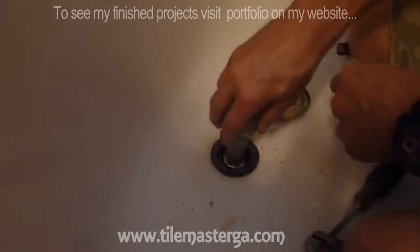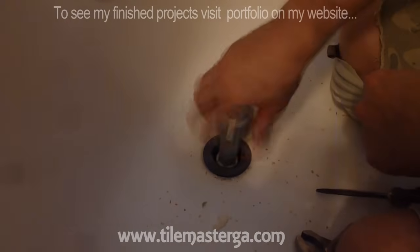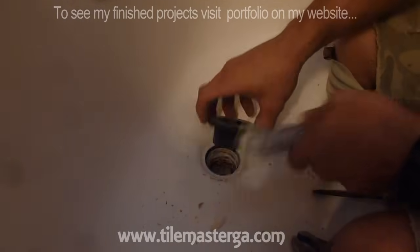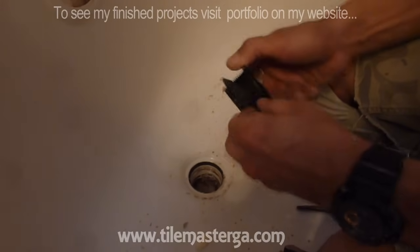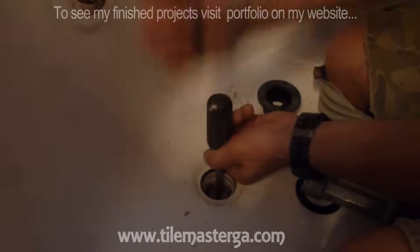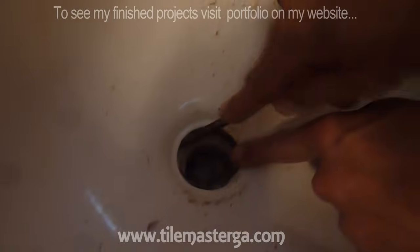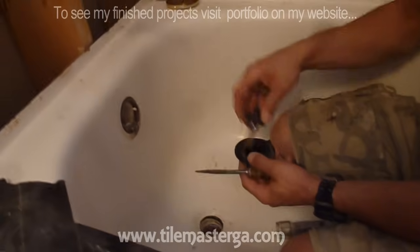Let me unscrew the drain now. I don't know who did that, but it was hardly in place — this was the easy one. Sometimes you have to use quite a bit of force to actually disconnect it. As you can see, we have a gasket here and all the elements. I'm checking if the drain got loose — yes, there's movement between the drain components. It kind of moves, which means it's separated and no rubber, gasket, or silicone is holding this anymore. So at this point the tub is loose and the next step will be to lift it.